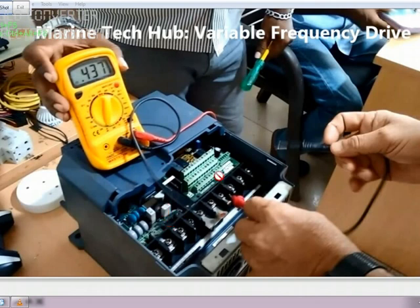Why is it designed for the lift? Because you have connections for the encoder here. What can go wrong is: the IGBT can go wrong — that is one part. The other is the power card can go wrong. The controller can go wrong. Or the encoder can go wrong. I will be explaining how to find one of the faults — if the IGBT is gone, how you are going to check that.